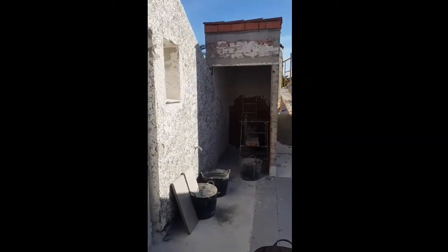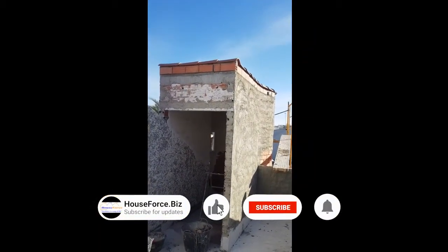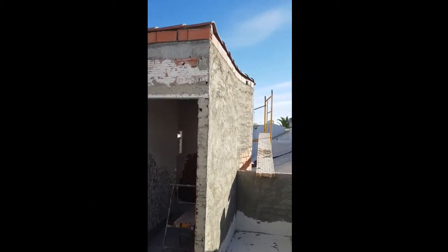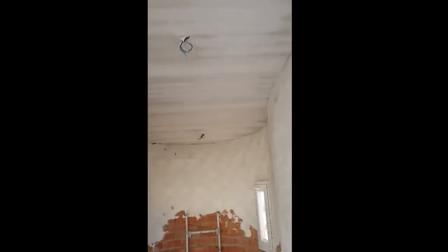Tower's up now, roof's done. Well, it's concreted, ring beams in, as you can see all the way around from a previous video, and putting scratch coat, yeah, cement screed with some water barrier inside, and I put a layer here of cement cola, another waterproof barrier, and we started prepping the ceiling with the same, and then we'll finish off with yeso plaster.